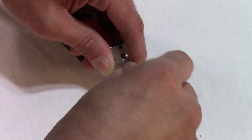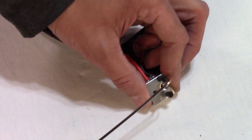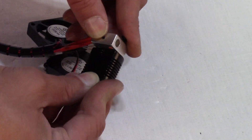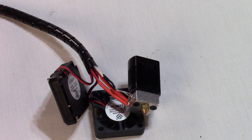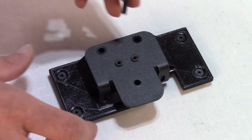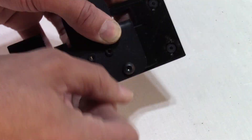Step 11: Reassemble the head. Set the two M3 by 16 screws into the heat block to the heat sink — the holes are slightly smaller, but with some pressure the screws will set themselves into the heat block and then into the heat sink. These two parts should sit flush with each other, though a small gap is acceptable, using a size 2 hex tool. Attach the head plate to the heater block — Recreator 3D Part 2 heater block plate, PETG — using the original three screws and nuts, locking them into place, using a wrench and/or pliers, Phillips screwdriver, and a 3 hex tool.